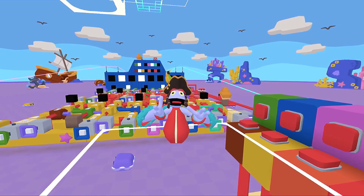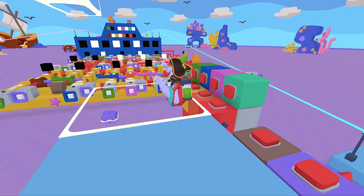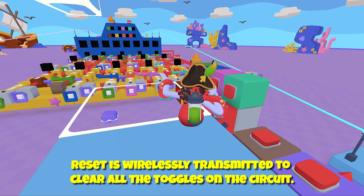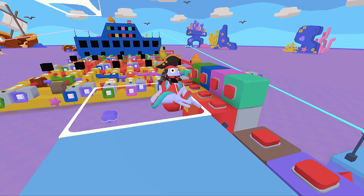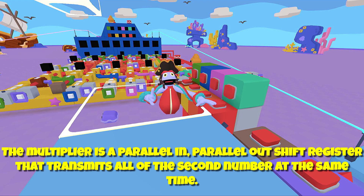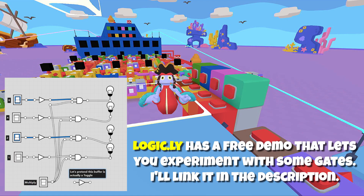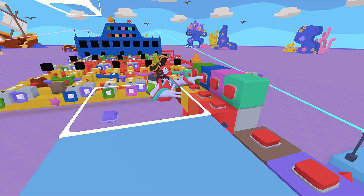The multiplier is much faster than I am, but you can see how that's working. I'm Rainbow and this is my multiplier. The reset button resets everything — you'll see the screens reset to nothing and it clears any memory in the multiplier. The button next to it is the actual multiply button. It's a shift register that I press last because there's a problem with signal propagation — I need to send all of the second numbers at the same time.